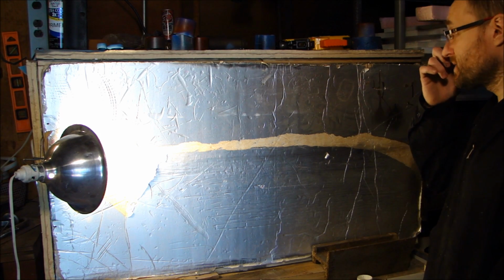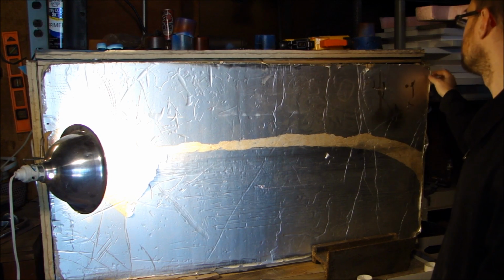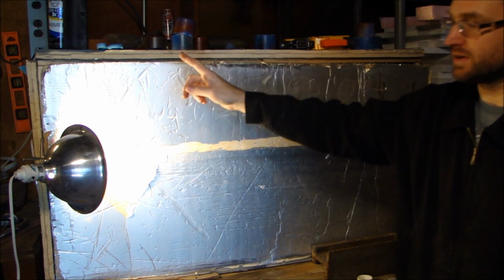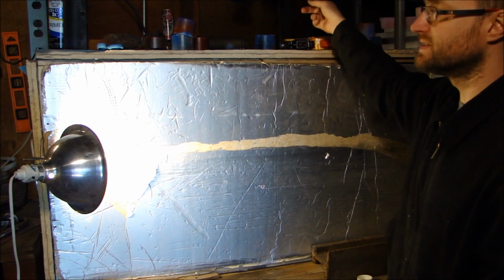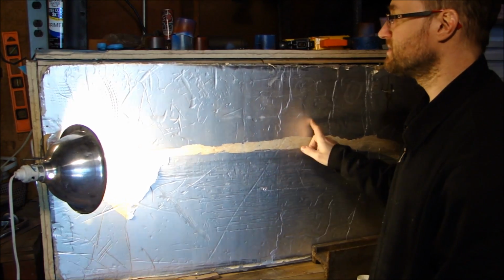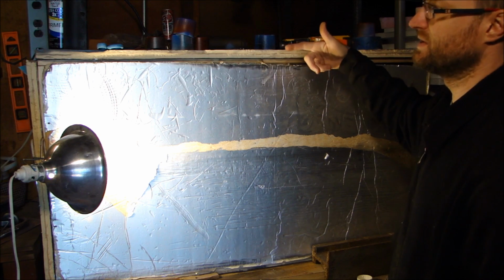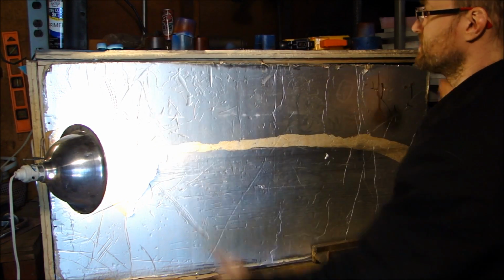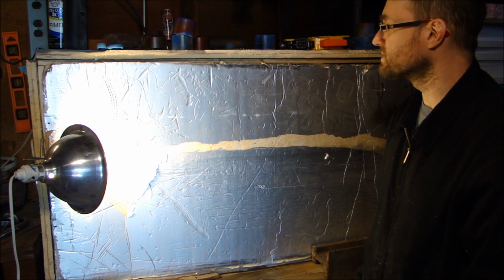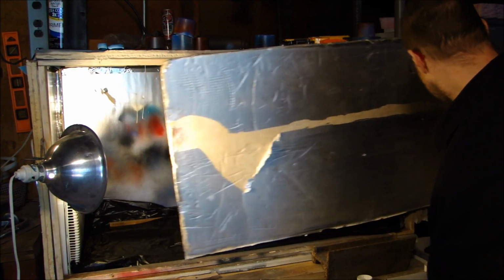So this is basically insulated styrofoam. Actually, I think it's like a fiberglass filled foam, but it's got this foil backing on it, and it's 4 feet long by 2 feet tall by 2 feet deep. So I use 2 sheets of this, 2 4x8 sheets. So there's 2 by 4 all the way around it is 1 sheet, and then you need 1 sheet for a 2 by 2 square and a 2 by 2 square. And then it's held together basically with drywall screws and 1 by 2s. And then it's got some things in it that help it cure the paint.